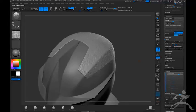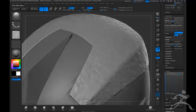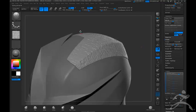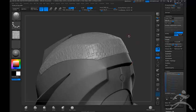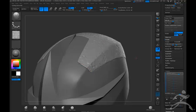And now you can see, you zoom in, I wanted to keep a little clean border here around the edge of our texture. And you can see our little bit of clearance, about 1/10 or so of clearance here that we created when we projected our duplicated and inflated and then inverted other panel that we created and projected the helmet into, that created our little inset that we now have. You can see now it nestles in there really nice, and when you print you can be assured that this piece will definitely fit into there perfectly.